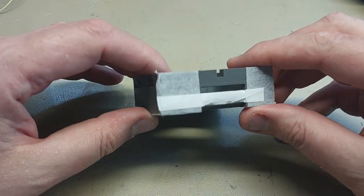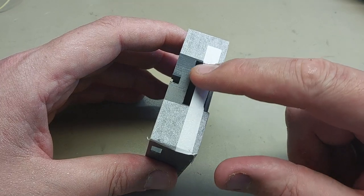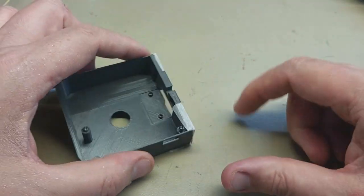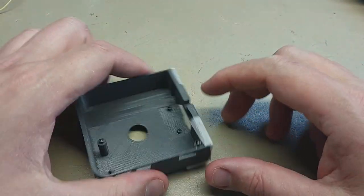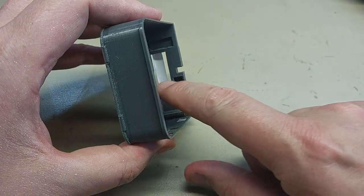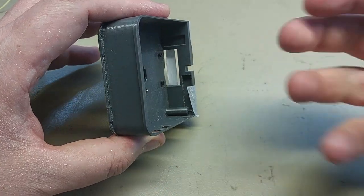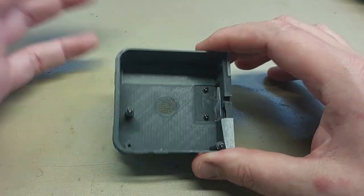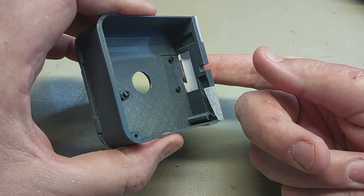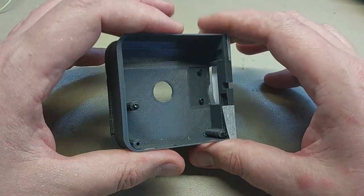My first thing to try was to take my cartridge and stick a piece of white tape across the front to simulate the real film. This piece of tape would have sat in the focal plane exactly where the film would on a real cartridge. The idea was then I'd put a camera behind it in the dark and it would catch an image as though it were filming a projector screen. I tried it — it works. The trouble is so little light gets through the tape that you need a very sensitive camera and your resolution to be honest is awful.